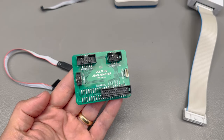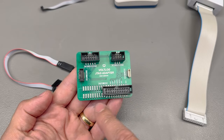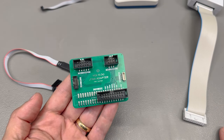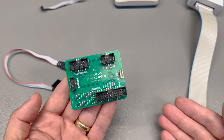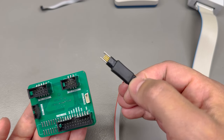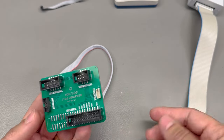This is a quick design I did in KiCad while on a plane trip. As you'll notice, I kind of messed up the footprint selection for the 20-pin connector — which should have been a 2x10 but I selected a 2x20 footprint. Luckily this doesn't prevent me from soldering the correct connector on the right side, so the PCB is still very usable. A few weeks later I got my PCBs, assembled the first one, and it worked perfectly. I also placed the footprint for the 10-pin Tag Connect model and added my Volt Link connector, in case I want to use the Tag Connect footprint as a general debug interface with UART and some GPIOs for flashing an ESP32, for example.